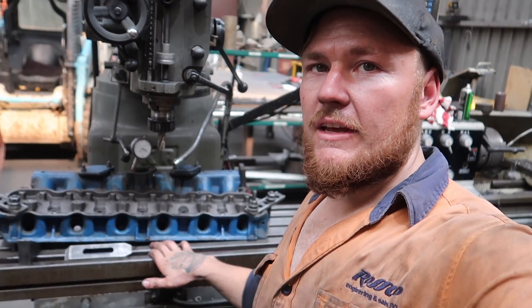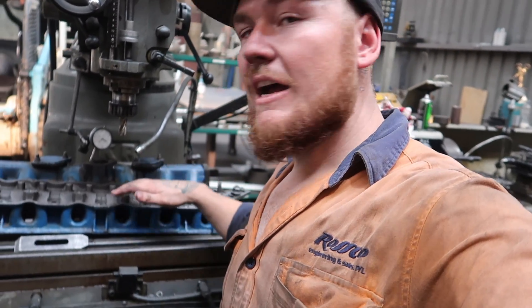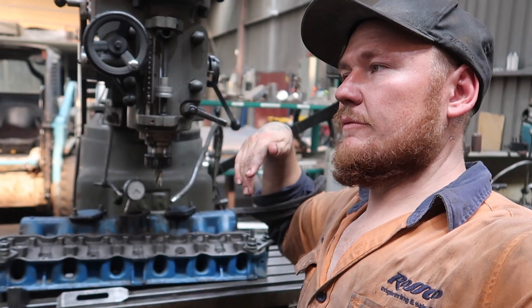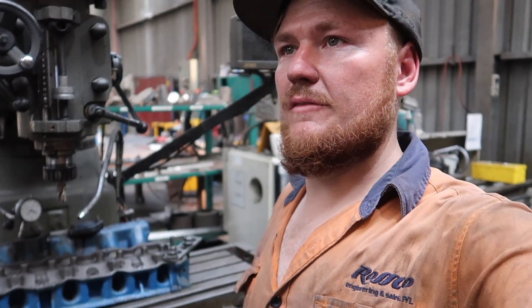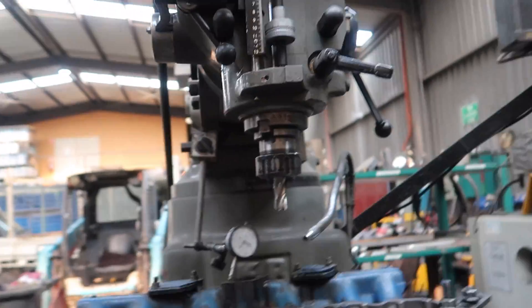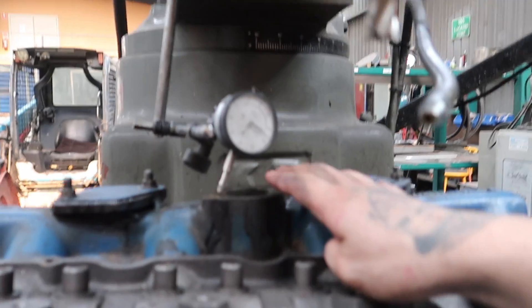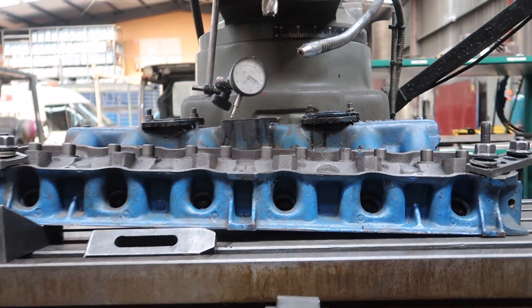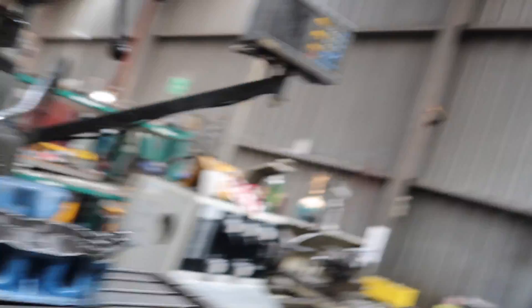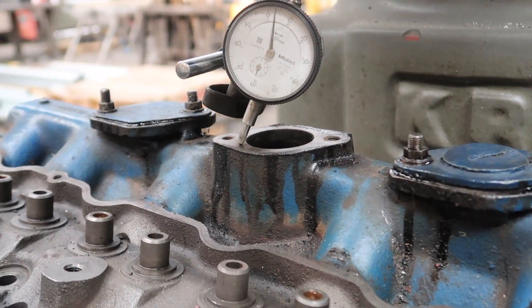I've finally got this head onto the bed. The carbies were tilted a little bit from factory - I think Ford had it that way to accommodate for air-fuel or something. So what I'm going to do now is use a dial indicator so I can get this face nice and flat and machine it relative to what it is so nothing changes. That's nearly flat, and that's how much height I've got. Once we get that it'll just be a few cuts, then a matter of welding that base on and going from there.